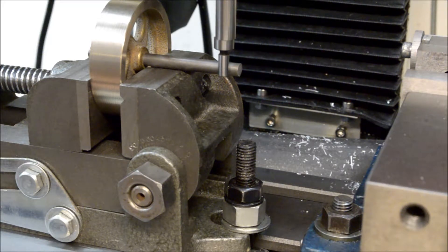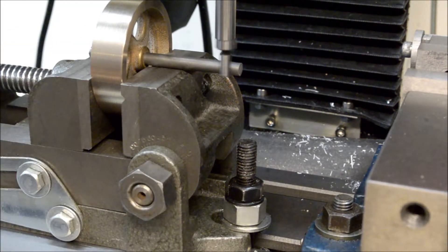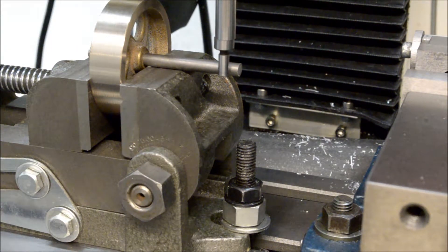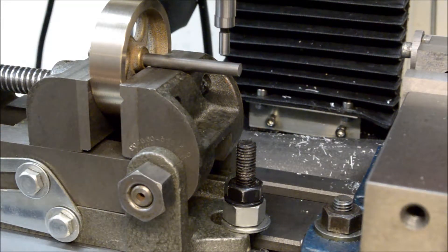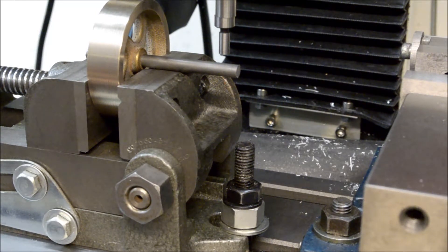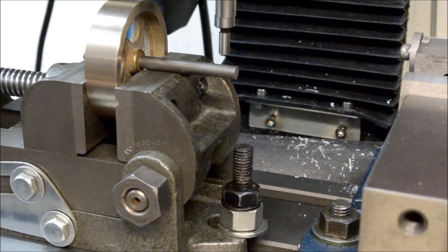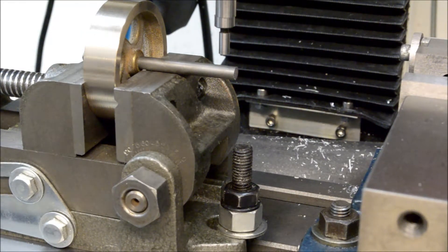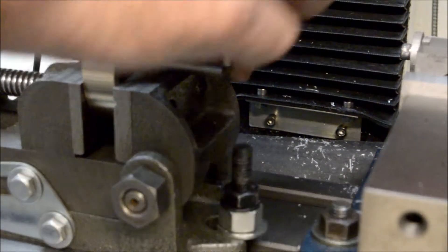Right there — that's where I kicked out. I'm going to bring that in and double check it. I'm going to bring this in a hundred thousandths; that'll put that on the edge. The shaft is two hundred and fifty thousandths, so I'll go in another hundred and twenty-five. So that is on the centerline of the axle. I'm going to go ahead and take this edge finder out.